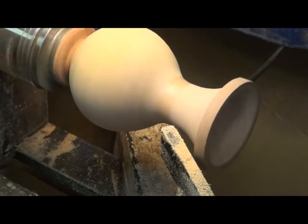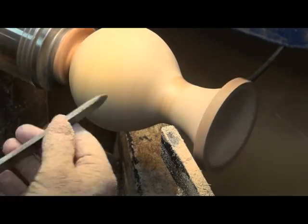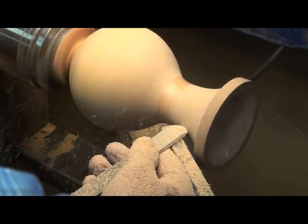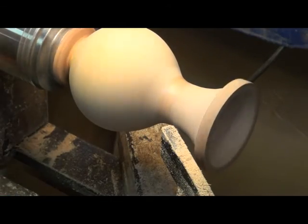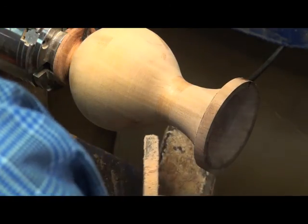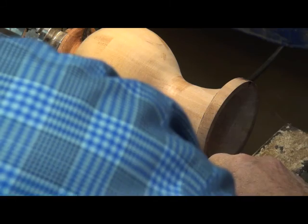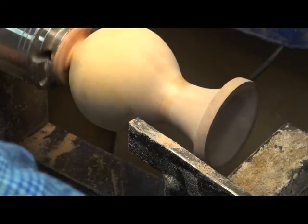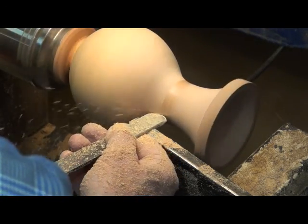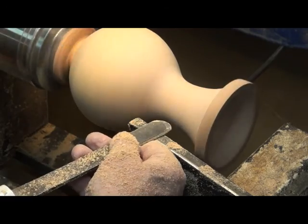Now sometimes when you have a hump or a bump or an indent, by the time you get it out, you're clear across the vase or whatever else you might be contouring. But it's very important that you take time and get those guys out. Like, I don't care for the off color I made with my gouge, so I'm going to go back and take care of that and make sure that things are flowing okay. And no, they're not. Right down in here I have a little bit of a flat spot.